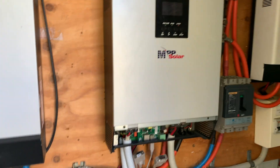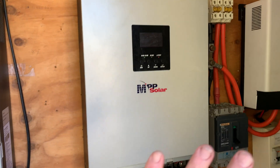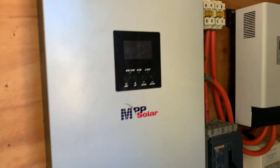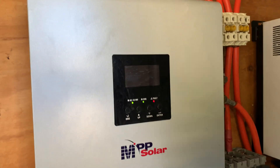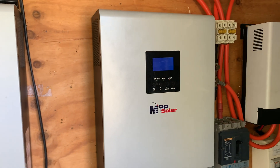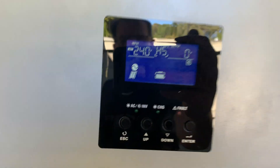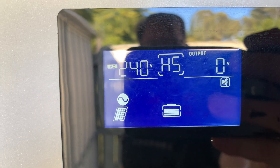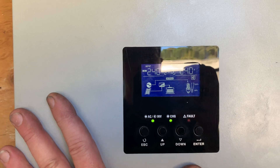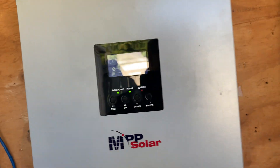I was up 50 metres away on my shed roof, and I thought I'll come and shut this down, wash the solar panels, and then come and turn it back on again. And it just does that. It does appear to be a relay — it's trying to click on and then off — so maybe I can just replace the relay. Once I took those cables out, that one is not erroring, so that one's still working. So that's kind of a good thing, I guess.